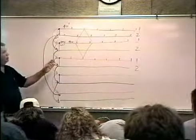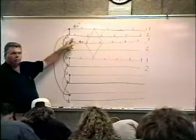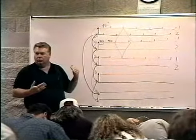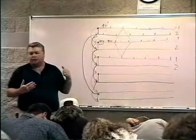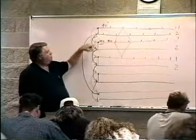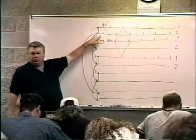Obviously the next step is wheel lines. We do the same thing with wheel lines. We can have the same options except the offset. We can't move the wheel line 20 feet sideways — you have to drag the whole thing sideways, can't do that. The wheel line is always going to roll, so our only option is to be able to put in swing joints.